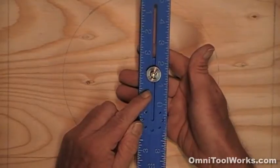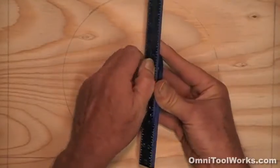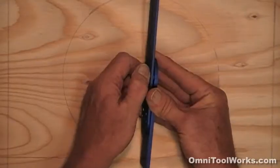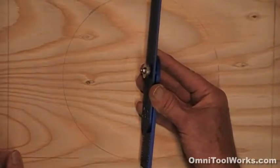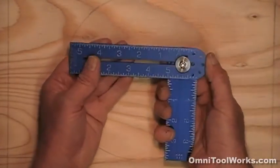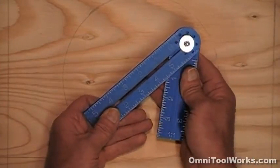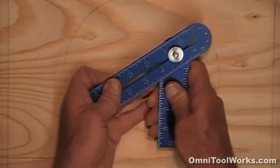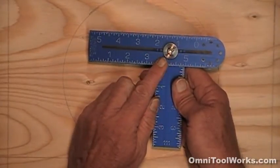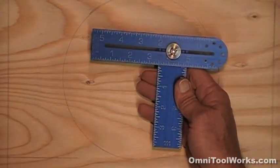Always before readjusting the blade, ensure that the knob is fully loosened all the way up to and in contact with the lock nut. Don't go cranking on it and cause the lock nut to turn — it's just finger tight. I never use the knob for the 90 or the 45-degree settings, and usually don't even use it for the quick bevel or combination square settings either. But it is there to more rigidly fix the location of the blade if you're going to make a lot of repetitive markings at that setting.